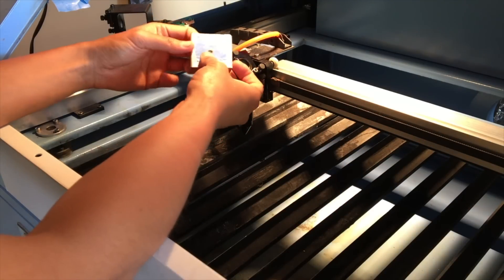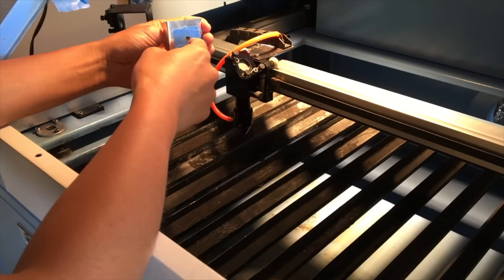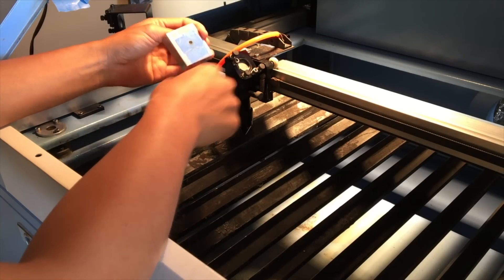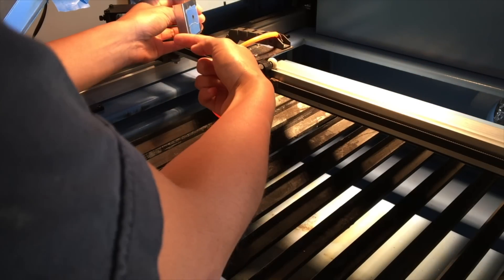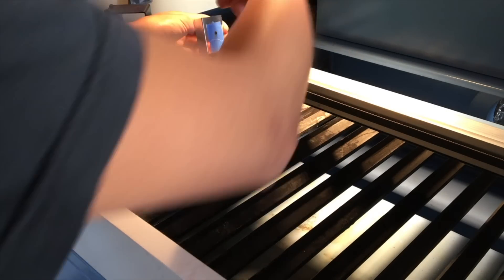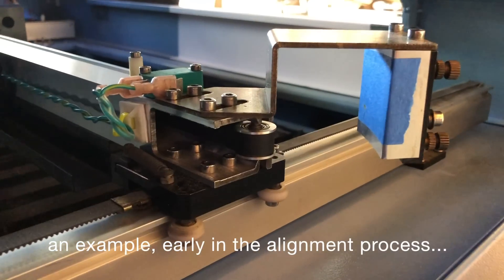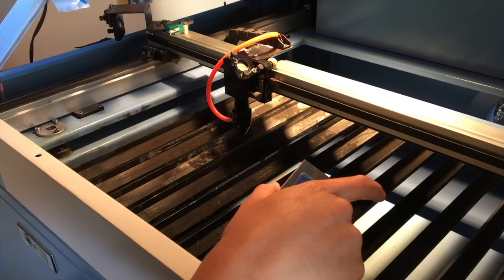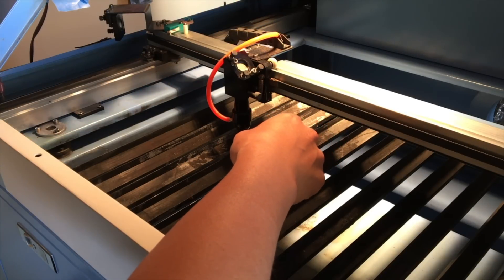To do that, I made this little sheet metal piece that clips over the mirror. That way, I can put tape on it and pulse without being afraid of damaging the mirror or whatever hardware is there. For example, with this axis here, I would move it up, pulse it once, move it all the way back, pulse it again, and make adjustments to the mirror back there until it hits the same spot along both positions. Then I know the beam is aligned to that axis, and I can move my tape to the next stage and align that mirror until it's angled correctly. I watched a few videos on how to do this, and probably they didn't convey what an iterative process this really is.